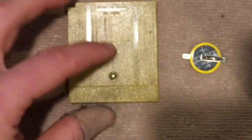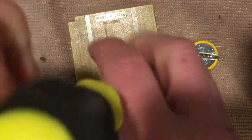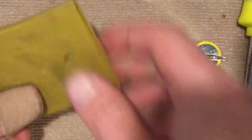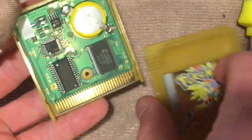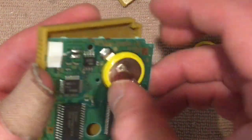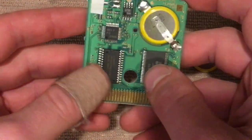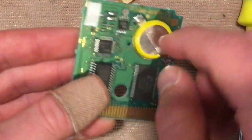First thing you want to do is open up the cartridge itself. We use our screwdriver bit and simply remove that screw — it's just the one screw, so we'll put that aside. To open the cartridge, all you do is slide the top down and it will come right off and reveal the actual game inside. This is a Game Boy game. The game itself is pretty simple — there's a couple of chips that control the actual game, the RAM, logic for how it boots, and then there's your battery. This is what we're going to replace in this tutorial.